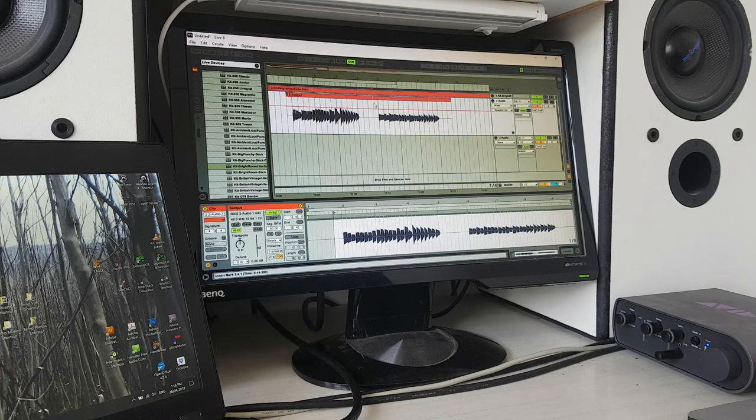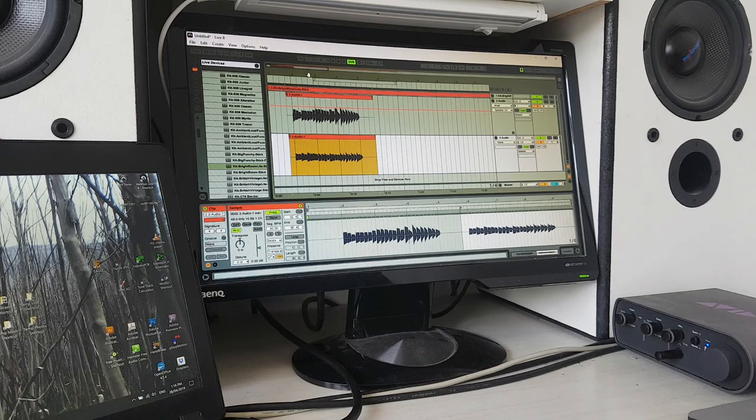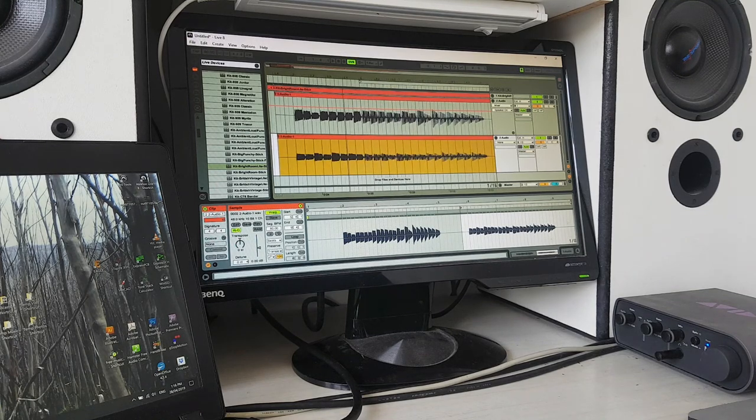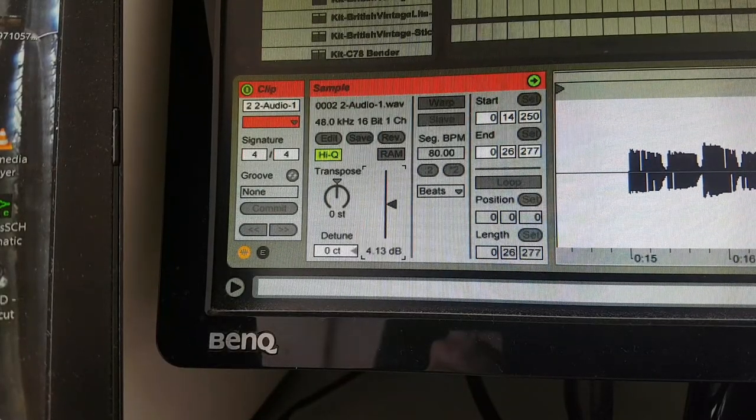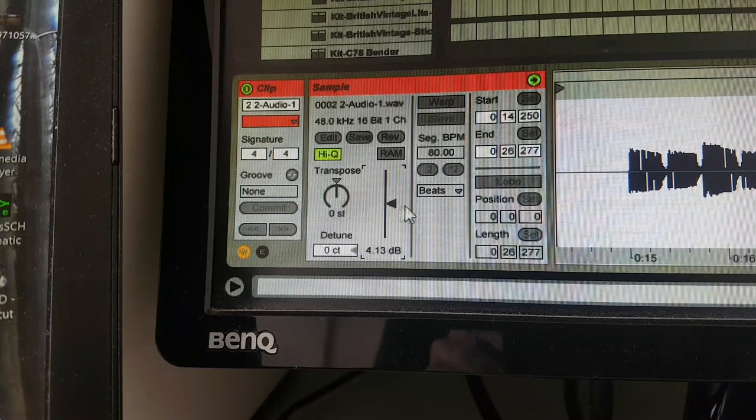Just tried to play that as evenly as possible, recording first one pickup and then switching to the other, and we'll just see how much I have to adjust that. So let me line these two halves of this track up. I've got the pickups adjusted to exactly the same heights, and I've just tried to play as evenly as possible on both of those. If I adjust the gain on the neck pickup side, it looks like I can get it about even visually with 4 dB.